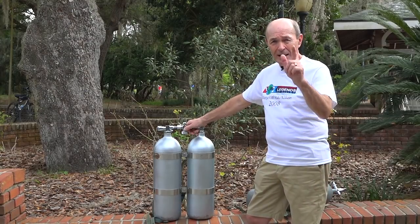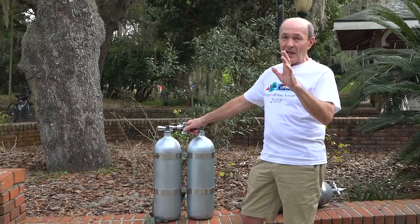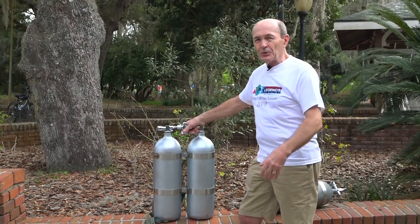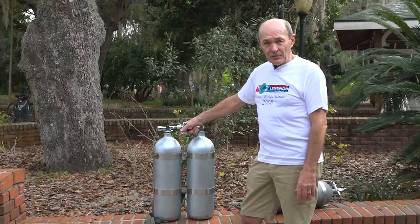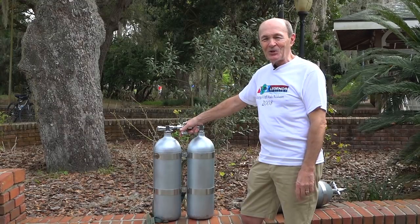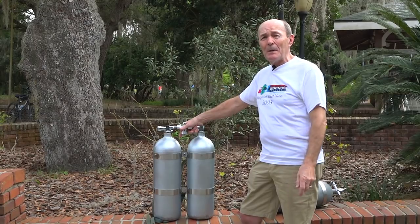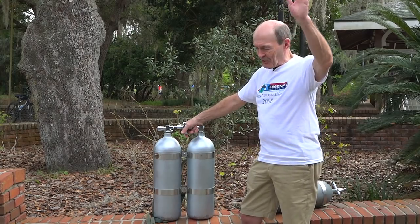So, bottom line, to answer your questions: can I use my old scuba tank? Yes, you can. Now there are some provisions — some old scuba tanks are no good; they're rusty or may not pass hydro. But get it into your local dive store. Say, I want to use this tank — take it for a hydro, give it a visual, and bring it back to me so I can start using it. If they don't want to do that, take it to another dive store. Some dive stores are reluctant to deal with old equipment, but there's no reason why not. Tell them to check out Alex Pierce on Alex Pierce Scuba Tech Tips if they have concerns. All right guys, that's it — a little bit about old tanks. I hope you have fun with your old tanks. Keep in touch. Take a look at our Sea Hunt Remembered playlist to see these tanks in actual use. 60 years old. All right, talk to you soon. Alex Pierce Scuba — I'm going diving.